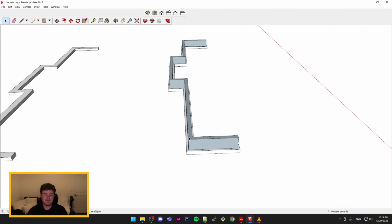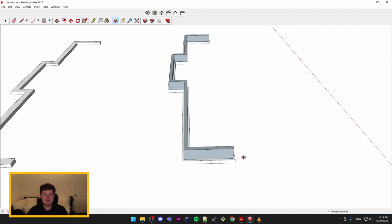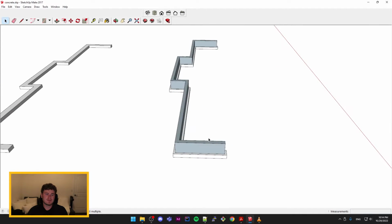The reason why we have 8 feet here is because we're going to have ICF blocks run to the corner, and we want to backfill it pretty much to 0 here, so that we have frost line. It's kind of complicated to explain why, but it makes sense in my head. So we can backfill and have the dirt start from 0 here and then go up.